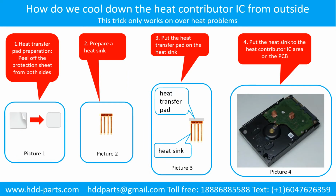How do we cool down the heat contributor IC from the outside? Step 1. Heat transfer pad preparation. Peel off the protection sheet from both sides of the heat transfer pad, like picture 1 shows. Step 2. Prepare a heat sink, like picture 2 shows. Step 3. Put the heat transfer pad onto the heat sink, like picture 3 shows. Step 4. Put the heat sink to the heat contributor IC area on the PCB, like picture 4 shows.